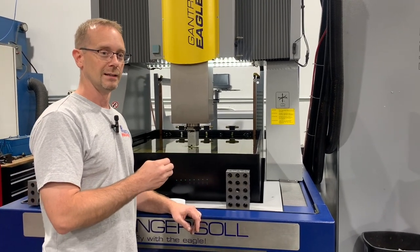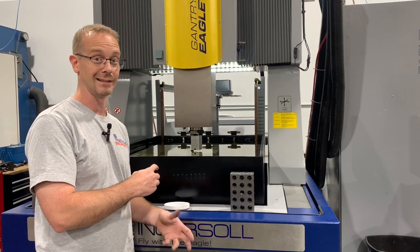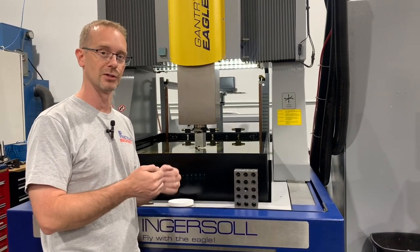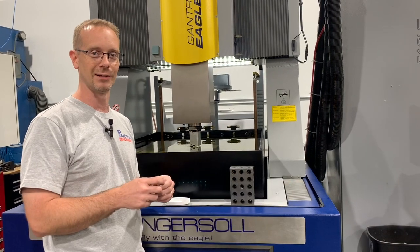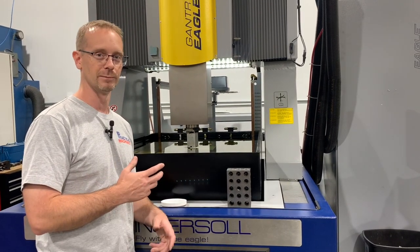So these we put in on every injection mold. Well, not every one, but almost all of them have some kind of gate, and usually they're sub-gated so that when the mold opens, the parts fall off clean. There's nothing to break off. There's no runner, like the old style model cars that you had to glue together. So sub-gates are another word for a vector burn.